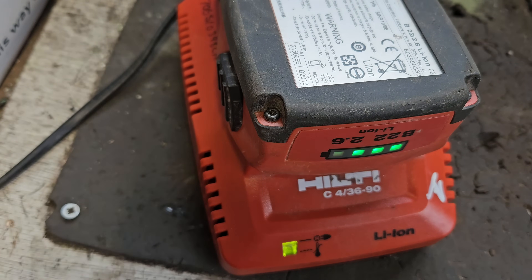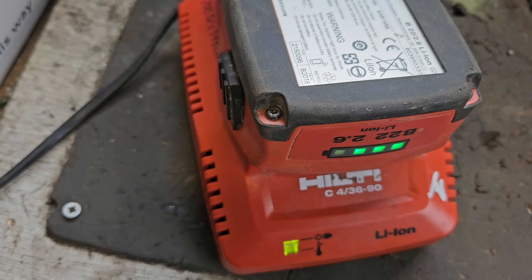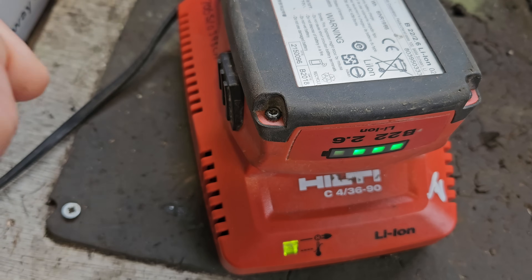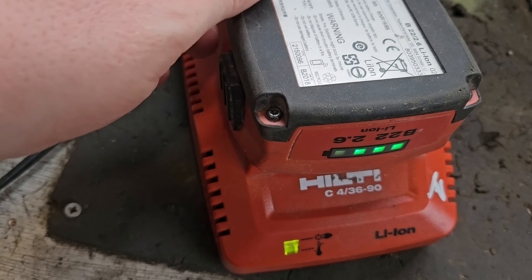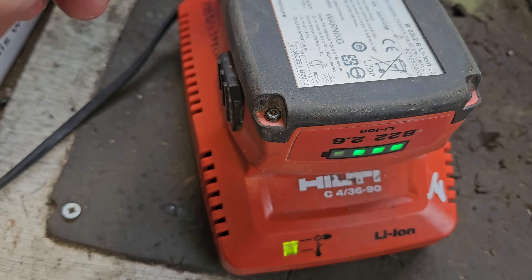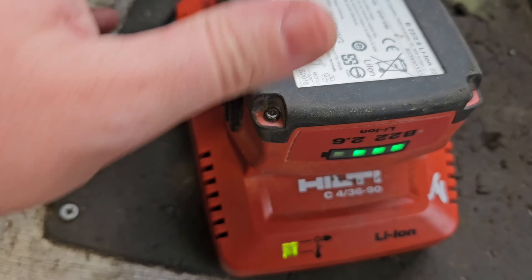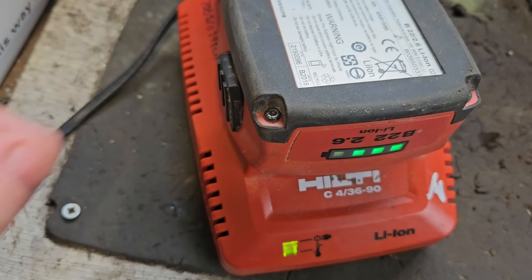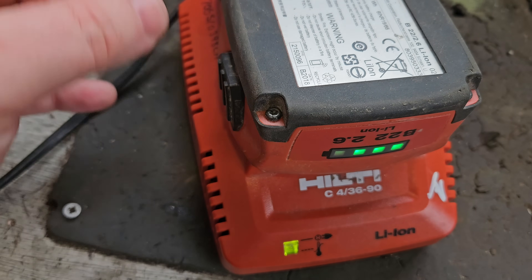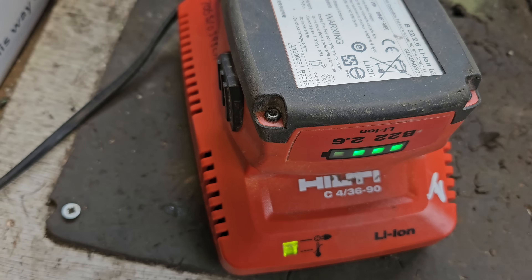This process I showed you will only work if the cells are all equal — all low and all equally low. Fine. If some of them are 3 volts and some are 2 volts and some are down even lower, that will not work — I can't do what I just did. You may have to replace some cells, you may have to bring some cells up and balance the banks. There's another process for that, and you will find it here on my channel.